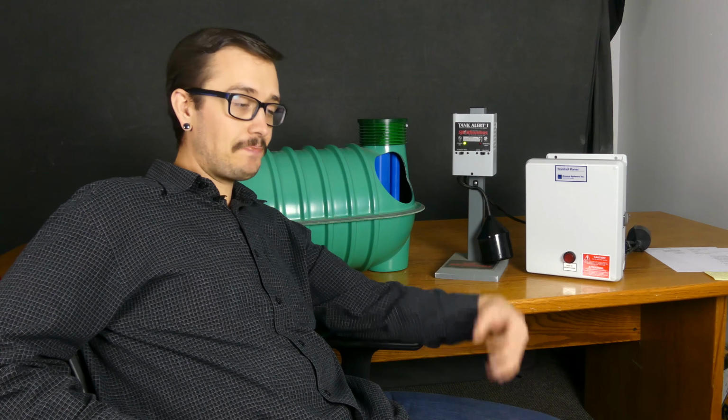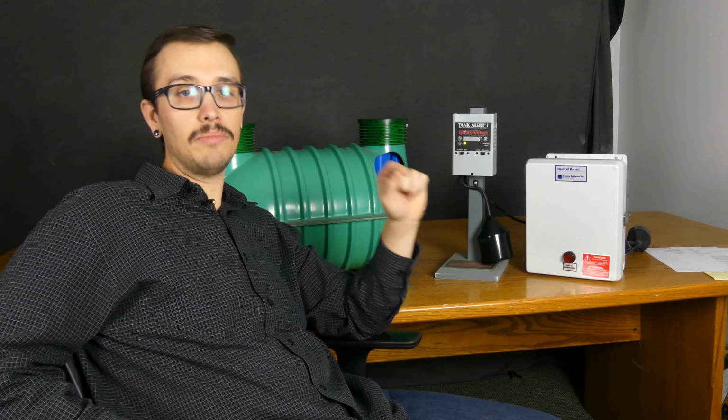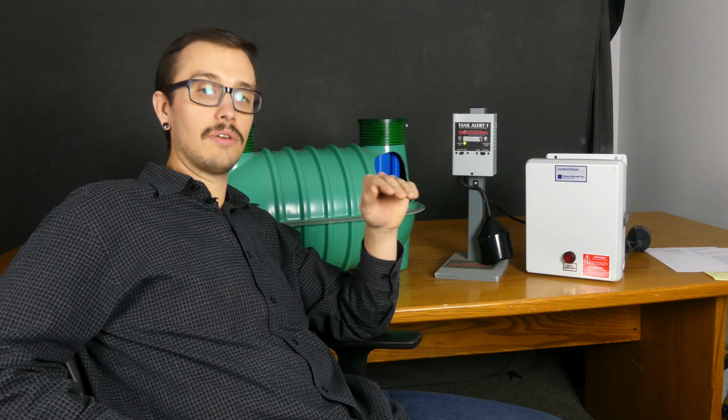or possibly it happens on a weekend and you can't get to it until Monday because that's when the septic guy is going to come out and take a look at it. It is critical, if you want to save that $200 or whatever it costs to have your tank pumped in your area, that as soon as that alarm goes off, you cease all water usage.